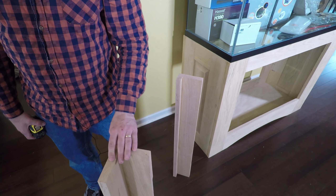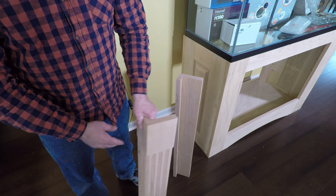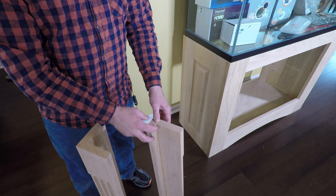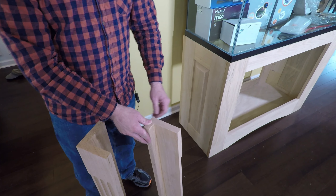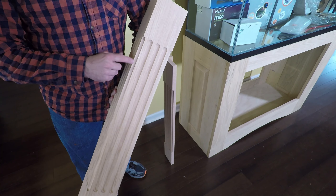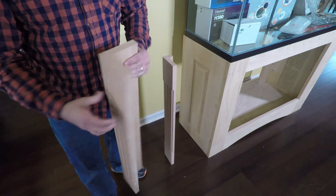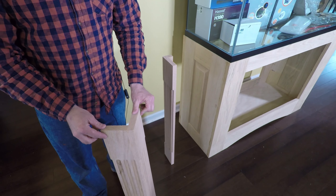The only difference between these and the ones on the canopy is that the canopy are cut to 15 and a half inches in length. The two corner columns that go on the front are slightly different from the ones that go on the back. You'll notice the ones that go on the back only have one full length face. The other face is simply there just to help me get proper alignment and to help me get the aquarium set in place when I'll be setting it in there dry. We're looking at one inch thick lumber that's 34 and a half inches tall and four and three quarter inches wide from the corners.